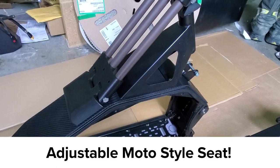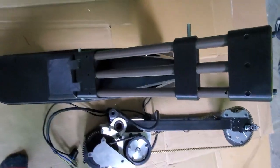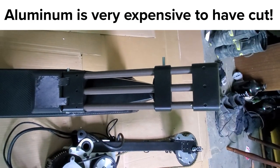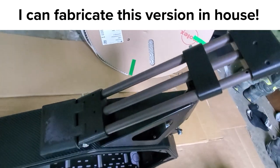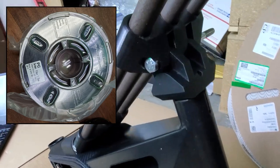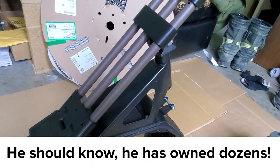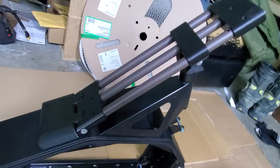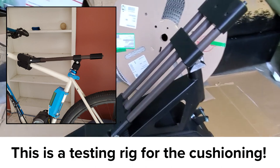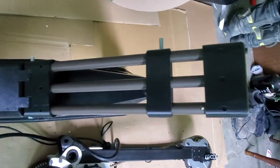A few weeks ago I shared the first design for an adjustable motor seat that would allow for towing — this is a full scale test version of an evolution of that design. Initially I've been looking at getting an aluminum piece fabricated for the seat platform, but with this design I think I can fabricate entirely in house. I have a roll of carbon fibre reinforced polycarbonate to print the parts — right now they are in PETG but it still feels very solid. My father-in-law said it actually feels more solid than a lot of the bike seats he has tried. For testing I've also made some parts that will allow me to try out the seat on a regular style bike so I can see what works best for comfort while the Lightning Rod's bike is being built.